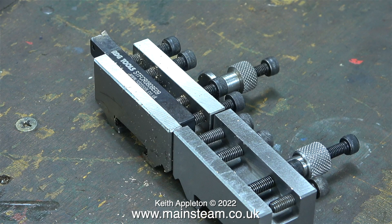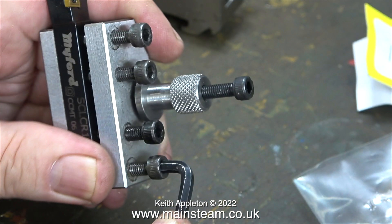I'll put them side by side so you can see. The finish of the external parts is about the same on both of these tool holders. These are both for my Myford ML7 lathe, and as you can see the left hand one is fitted with the lathe tool from RDG Tools. This particular lathe tool is good but not for all operations - it's great for facing and quite good for turning, but I do prefer a lathe tool with more of an angle on the carbide tip.